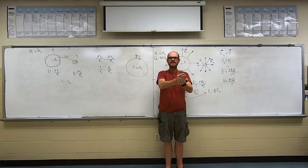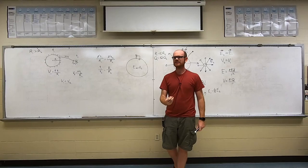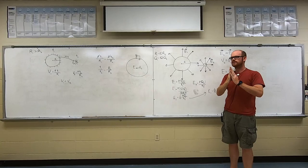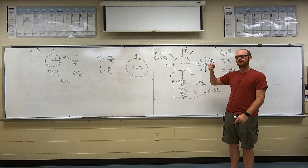The idea is that lightning will strike the lightning rod because it is way up high, and it keeps the lightning strike from hitting something else unintentionally. In other words, it directs the lightning to a point that keeps it from causing damage to anything else. The way the lightning strike works is because it is pointed. The curvature of the surface at the point causes a very strong electric field because the radius of the curvature is very small.